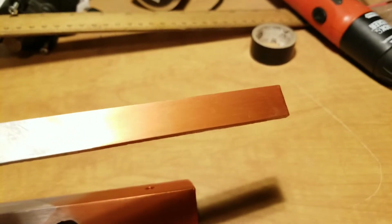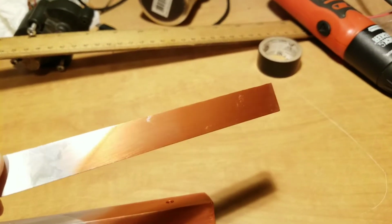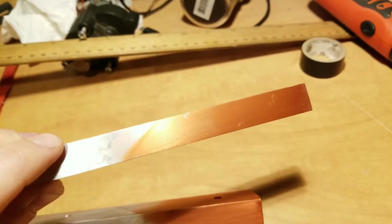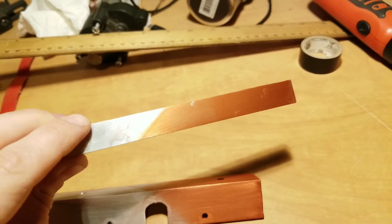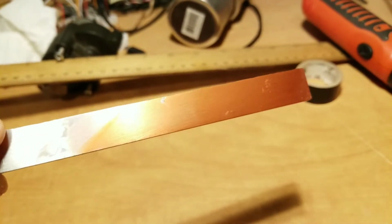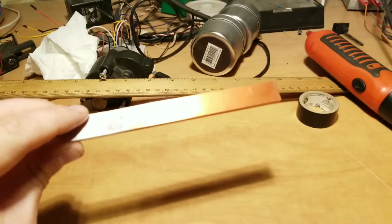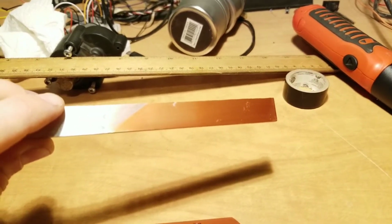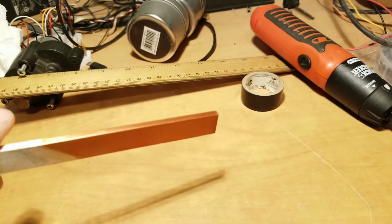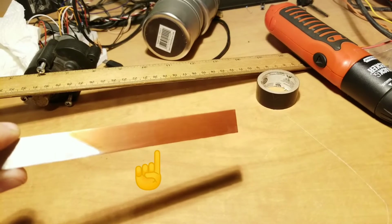And this one I did most recently. This one was an interesting experiment because I anodized this the day before, and then I dyed it, but I put half of it into the acid bath for about 30 seconds to reopen the pores, if that's a thing. I had read somewhere online that that's something people do if they anodize and then up to a week later want to dye it. And if you look very carefully, I don't know if the camera's going to pick this up, but there's a very faint line in the middle. It's a little bit lighter at the top and a little bit darker down here. That's where I dipped it, about halfway in the acid. I'll put some on the screen here to highlight it.